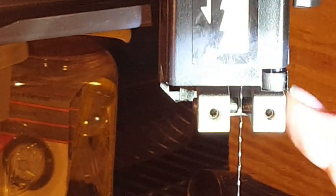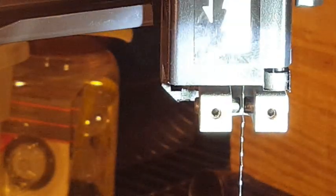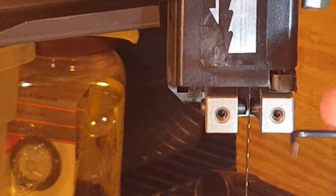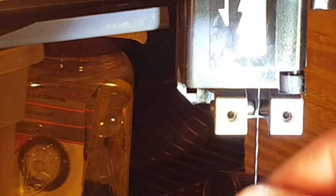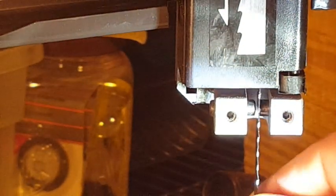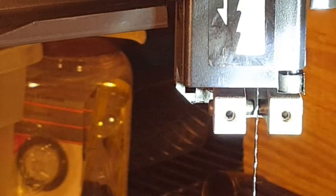The only other setup I'm going to do is adjust these guide pins. There are a couple of hex-head Allen key set screws right here — you loosen them with the Allen wrench that comes with the machine, then push the pins in ever so slightly so they just miss the blade as it goes by. These pins keep the blade from deflecting or twisting too much. There's a pair up here and another set to adjust the same way right underneath the table top.